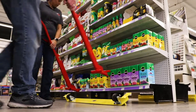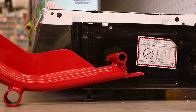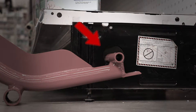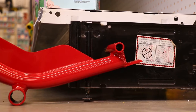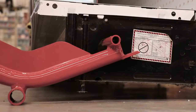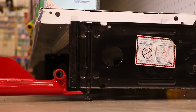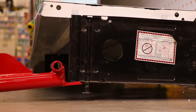If the weights are within the guidelines, use two of the original GondolaTrain jack handles to lift the first section by inserting the cross pipes into the conduit holes of the brace brackets on the same side of the section. Be sure to not lift the gondola more than an inch and a half off of the floor. If the shelving unit does not have a conduit hole, you can use the tip under the brace bracket to lift the same way.